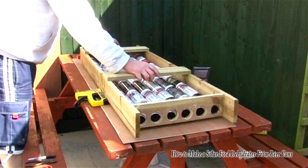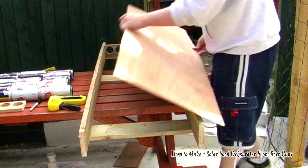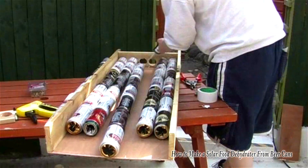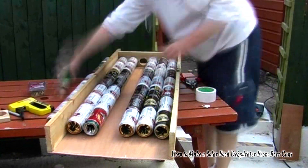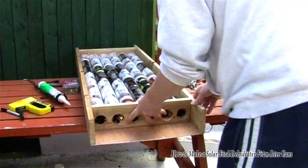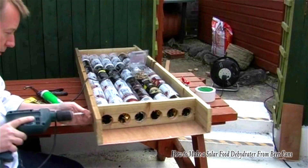With the temporary struts in place I can now lift away the main assembly and apply the back. Applying the back is simply a case of using small screws around the edges. Once the back has been attached you can flip it over and remove the temporary struts. Now it's just a case of gluing the cans into position — using an instant grab high bond adhesive, gluing the cans all the way up the back so they don't move around. Once the cans are in place it's just a case of sealing them so the top and bottom areas have a clean run-through of air, with no areas where the air goes anywhere other than inside the cans.